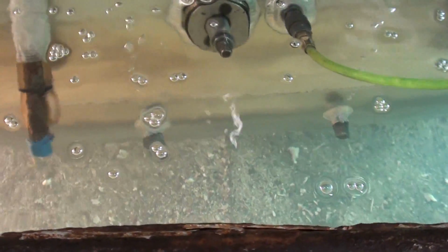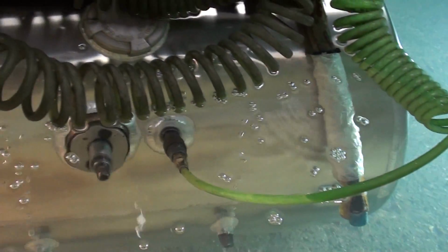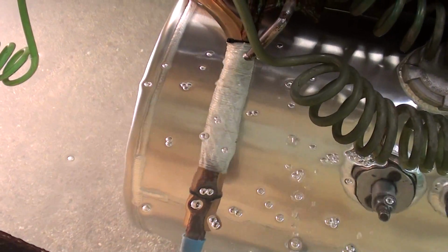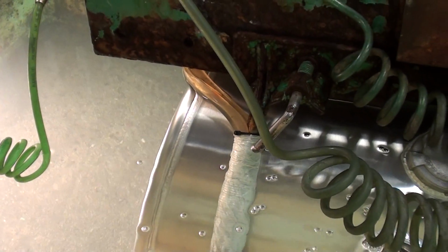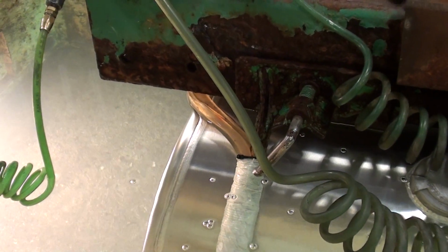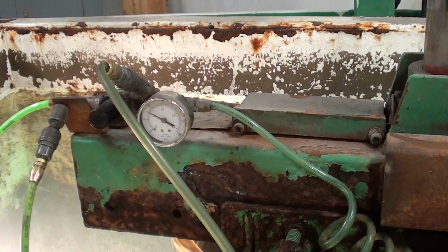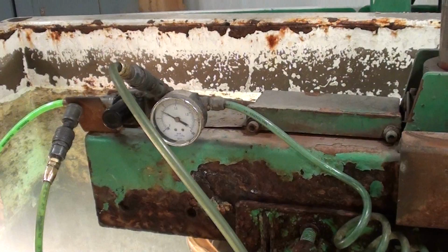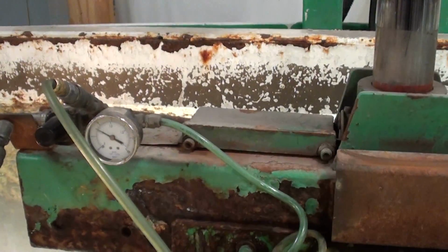What's interesting about pressure checking these is that you will look very carefully and you can see tiny little bubbles coming up from an intersection where the weld is stopped or something. And by having the pressure inside the tank, submerged underwater, that's the only way you would find that leak, because they're minute leaks, some of them. Very minute. And you certainly don't want to find the leak after the customer gets it and he goes to the truck stop and fills the tank full of diesel fuel and it starts leaking. You got that right. And what's your pressure here? It's about 10 to 12 pounds pressure.